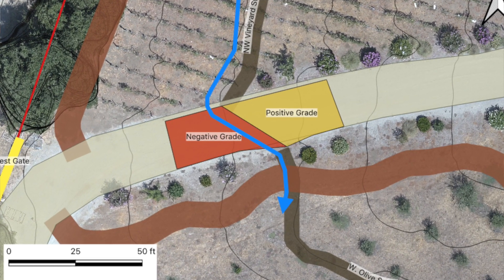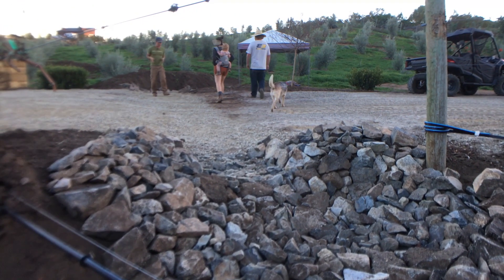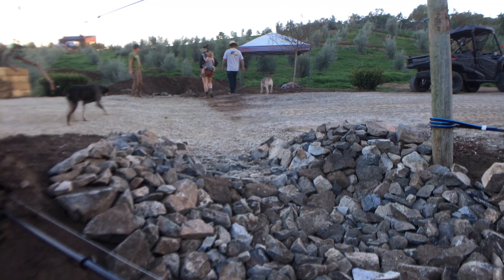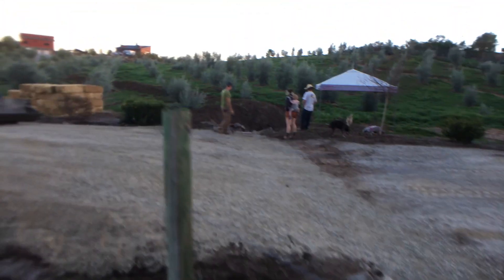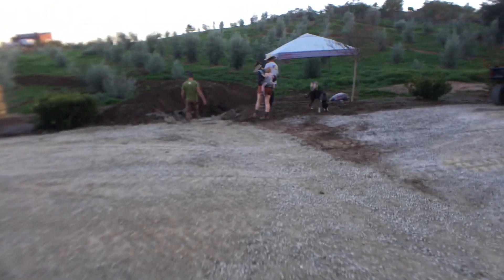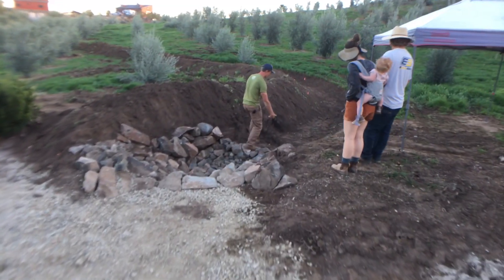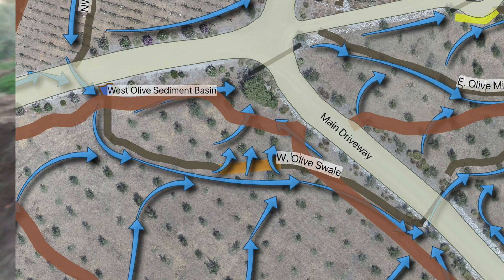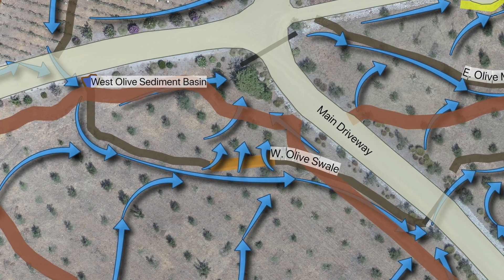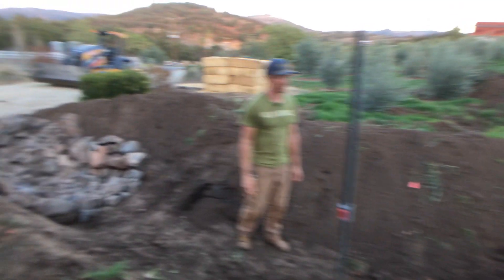Rolling dip one takes the water from Carancho Road through the northwest vineyard swale, across your driveway, and deposits it into another dissipation pool and into the west olive swale. Same deal here — level sill, a place for the water to calm down and drop its sediment load, and then it transitions over this sill and moves out really passively on contour all the way across the landscape until we cross the driveway again at what we call culvert three. Gophers have already been fast at work remodeling.